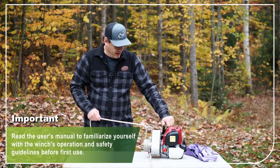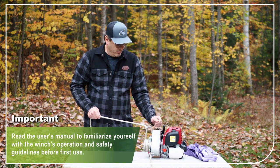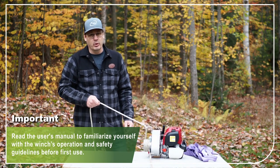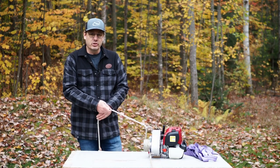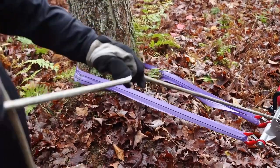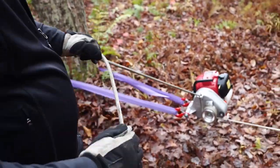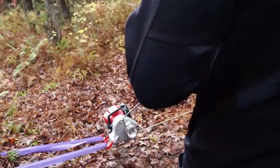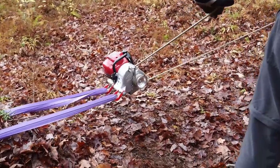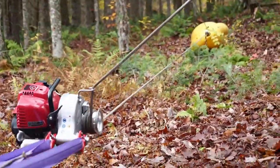We operate the throttle after starting the engine, of course. We bring the power up to maximum and pull on the rope. What we want is to pull as fast as the speed of the drum. Sometimes customers say they don't have all the friction on their drum — that's partly because they don't pull at the same speed. So they create less friction on the drum, which means it can slip on occasion. Pulling at the same speed as the drum prevents this.